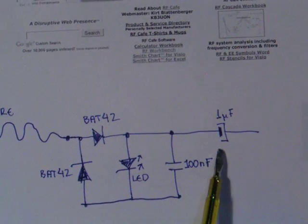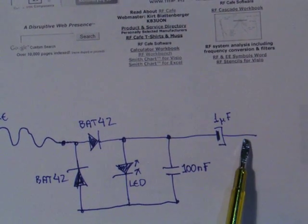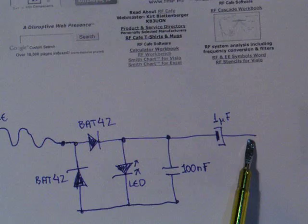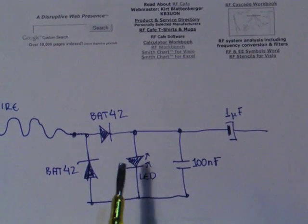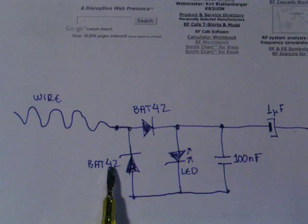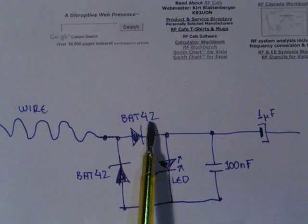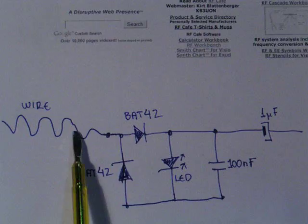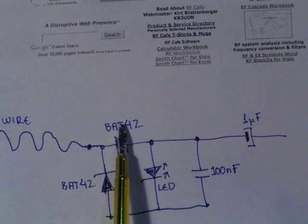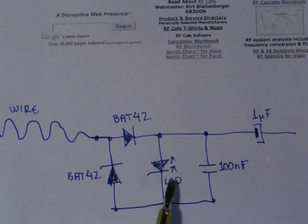This is actually my addition: a very small electrolytic capacitor which is going to be used to monitor the output using an audio amplifier — we're going to see how the output sounds. Ideally, I would love to have BAT41 Schottky diodes instead of BAT42 because they have an even lower forward voltage, approximately 0.25 volts instead of 0.45 volts. The lower the forward voltage, the less potential is established across the diode, which means more voltage is provided for the LED so it can turn on easier.